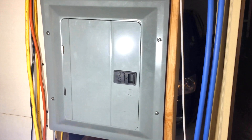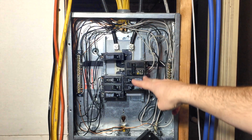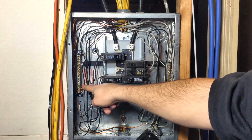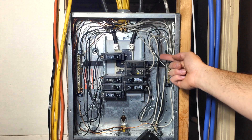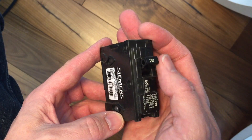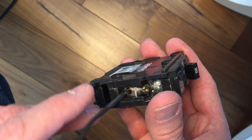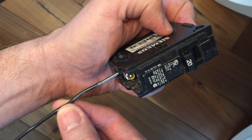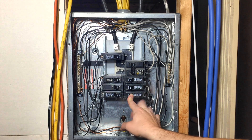Last we'll look at how to wire into a circuit breaker box, and we'll start by removing these four screws. Always make sure the main power to the box is shut off before you work in it. All your house wiring comes in here from the top. The copper wires go over here to the grounding bar. The white wires go over to this other grounding bar, and these two bars are actually connected by that black strap across the back. The black source wires go around and into all these breakers. A circuit breaker is like a switch that shuts itself off when there's trouble. This connects to the power bar in the back of the breaker box. Your black power wire goes under this lug, and you tighten it down with a screwdriver. We use a 20-amp breaker with our 12-gauge wire, and you can put up to 10 lights and outlets on this circuit. You add new breakers by putting them in at an angle and shoving down here. This turns on the power to the circuit.